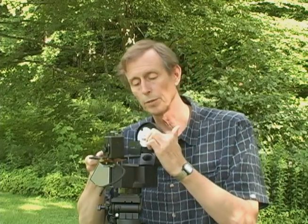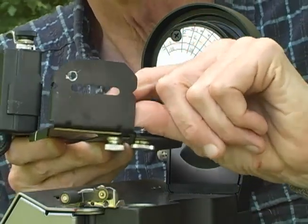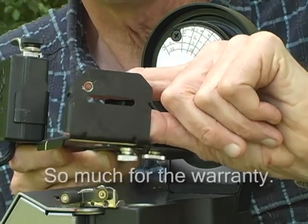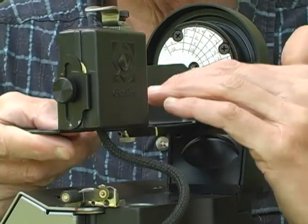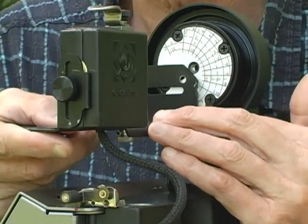So here's what I did. In order to align a big lens with the center of the tilt motor, the camera tray has to be lower. Instead of attaching the camera tray with a thumb screw through this slot, I added a hole above that slot and a little bit forward of it, so that when the camera tray is attached with that new hole, it can be adjusted several millimeters lower than it was before and also a little bit back.